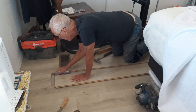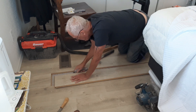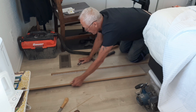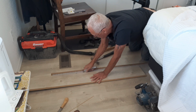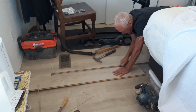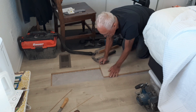I have to cut a couple of the edges. It's a tongue-and-groove locking system — they both look like tongues — but the one that sits on top, I'm cutting off here so it can drop down onto the side where the hammer is and then be glued. You try to cut it back at an angle so you get up underneath it, because you don't want anything hanging out or it'll catch on the top piece of laminate and chip it. You want it to just drop right in, but tight enough so it's not loose.